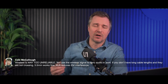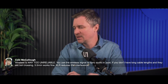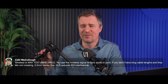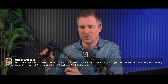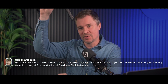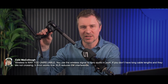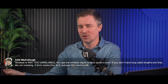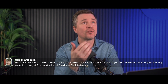All that is true. So yeah, I use XLRs, but a lot of people are going to want to plug a microphone straight into the 3.5 millimeter jack on their camera. I did that for a long time with one of the Rode NTG mics. I took a 3.5 millimeter cable, about a 10-foot cable, from my shotgun, put it just out of frame, and ran it into whatever camera I was using, into the 3.5 millimeter port, and put my Sony volume at about 7, and that worked great. But of course, I've stepped it up.